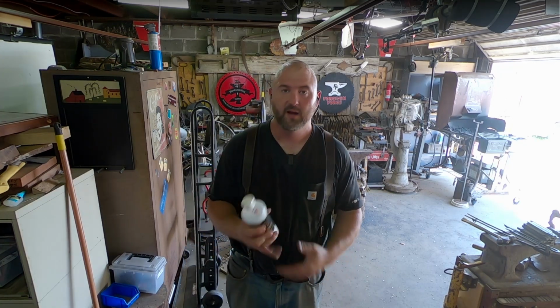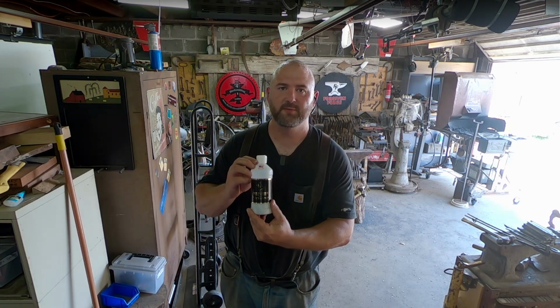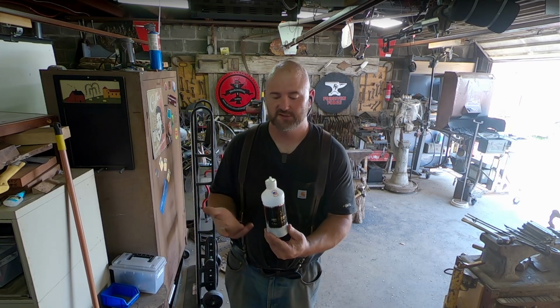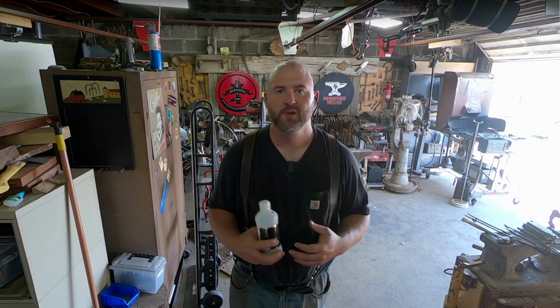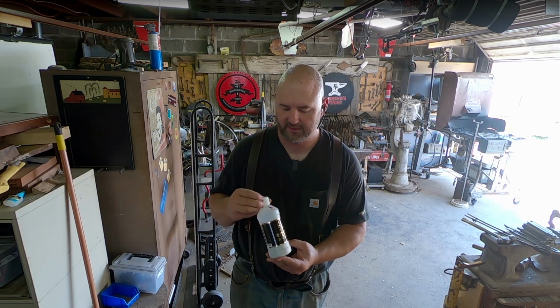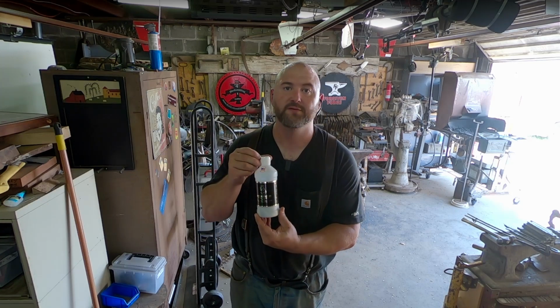I got this welding flux you're going to see me put on there. It comes in a nice squeeze bottle. It's called Iron Mountain Flux. It's not cheap. Flux helps clean out the scale so that the steel is clean when it's welded together. I did clean all the pieces before I welded them, and cleaned them after I tack welded them, in the hopes of getting that to work. But this is just to help even beyond that. Some people do it without this flux, but this is what you'll be seeing me use.